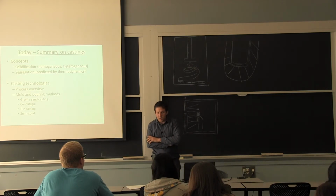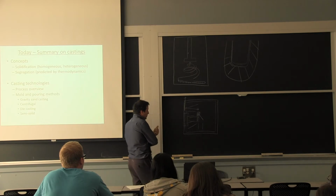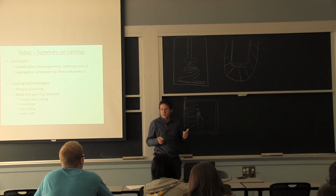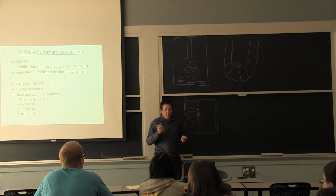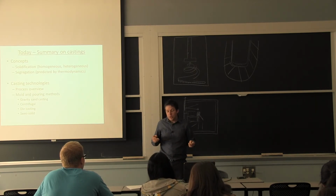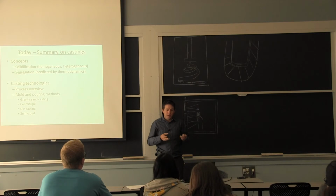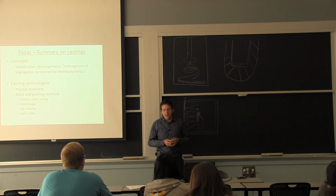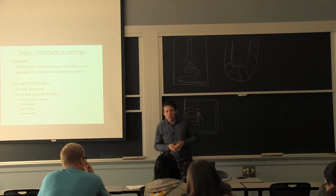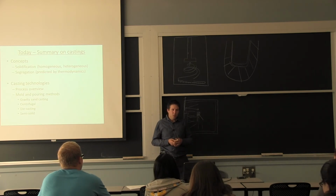What the hot deformation processing is going to do is allow for diffusion. It will allow for diffusion because you're hot, but also because you're deforming. Deformation itself favors the movement of the different atoms to get the microstructure more homogeneous. What I think you'll find helpful in the next lecture is we're going to talk about grains in material, in that context: what happens to the grain and what we can do with grains through that hot deformation process. And I'm not going to go crazy with dislocations. I know you're not all course 3, and even in course 3, not everybody likes it the same way, but we'll have to talk about it in a general sense because it does come into play.